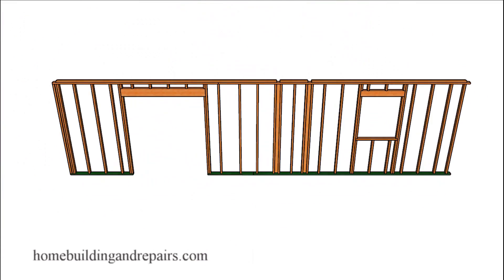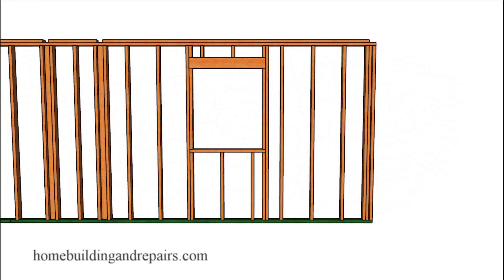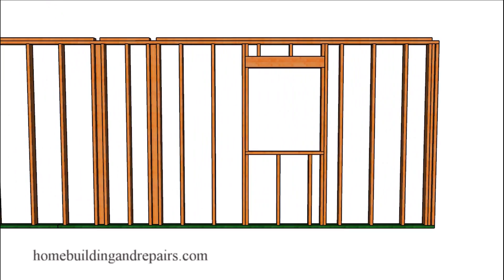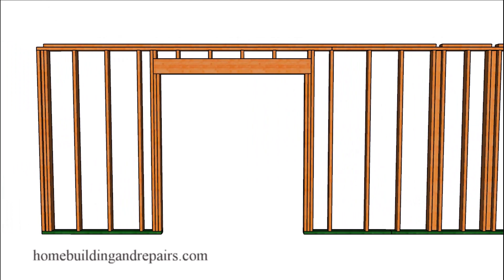At the back of the house we're going to have either a sliding glass door or French doors, plus a bedroom window and two intersecting walls. By now you should be getting a good idea of how the upper framing plates connect together along with the backing required for intersecting walls. We have double trimmers again — it's a standard rule of thumb to have two trimmers on any opening that is five foot or larger.